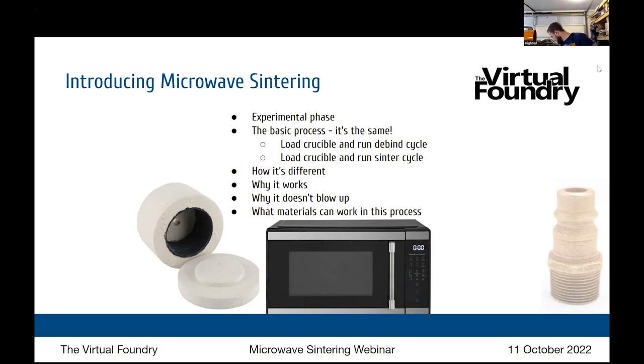And that sort of spawned the other idea. My first iteration had, as you can see in the picture that you have, Tricia, the silicon carbide painted around the sides and hardened in place. And so that's where your heat's going to be given, in a circular area. But this is a standard coaster mold, but the coaster had an inset in it, and I printed a silicon carbide element, also Virtual Foundry filament, and put a layer of refractory.